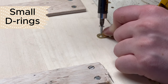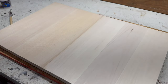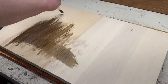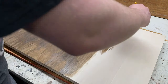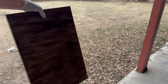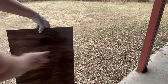I want this to be hung on a wall, and in order to make that possible, I'll use some small d-rings. I added two of them to the top of the piece and secured them with screws. I was debating on what color would look the best for this, and ended up going with a dark walnut stain — I think it was the right choice. I applied an even coat over the front of the board, as well as the sides, top, and bottom. I also want to protect the wood, and normally I'd use something like polyurethane, but it's expensive and I don't have any on hand. I'll use a gloss spray paint instead — not only will it protect the wood, but it'll also give it a shiny look.